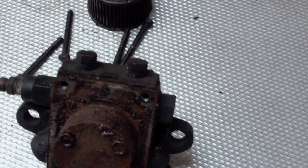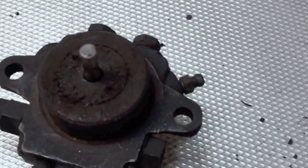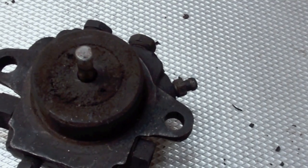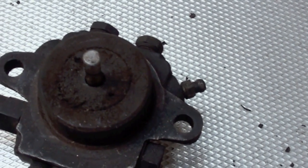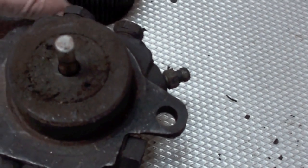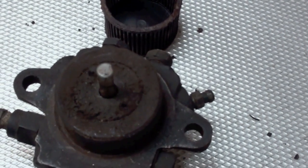This side here is the shaft — the drive shaft — that fits into a coupler that comes off of the motor. What this one did is lock up and the motor went out on the manual reset limit. So here we have a dead pump. And again, those screens should be taken out probably every two to three years and thoroughly cleaned.